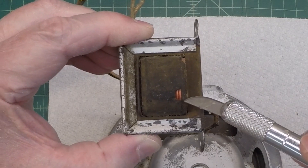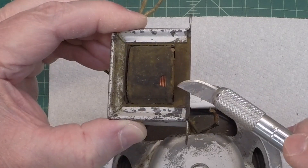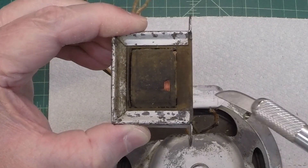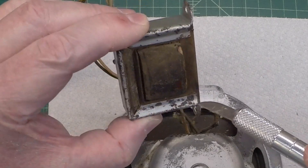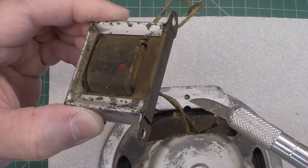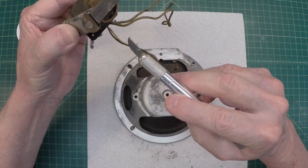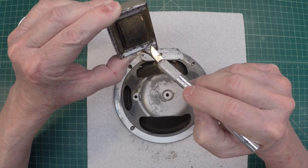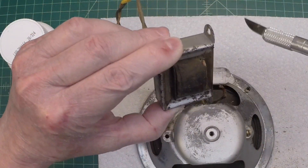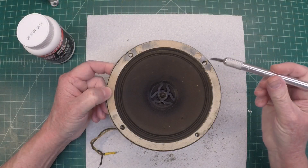The good thing is it appears that our secondary winding is on the outside, and you can see the gauge wire there is a little thicker, probably only 20 to 25 turns of magnet wire. So I think we're good there — everything checks good. We'll look at the impedance of what's reflected back to the primary a little later on.